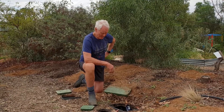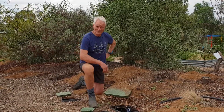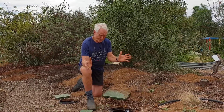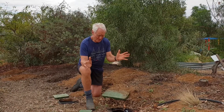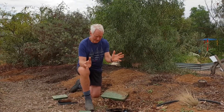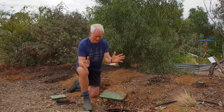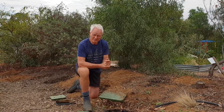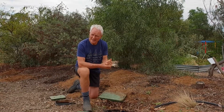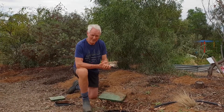Over the longer term we're looking at having more of an above-ground system. Currently the system works well when it's working, but we need more controllers and some mechanism for recording and monitoring our water use — to give us a better idea of whether we have a leak and where it's coming from. Just recently we were notified of a leak of 60 liters an hour, costing us roughly $250 a month, which is quite significant. We've yet to find where it is in the garden.